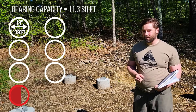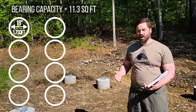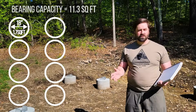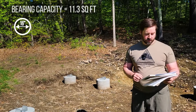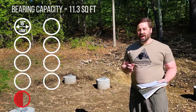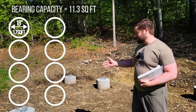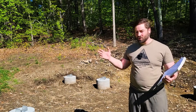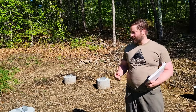So we take the 11.3 square feet that we need and divide it by 1.7 square feet per footer, and that means I need 6.6 footers. You can't have a fraction of a footer, so we could round up to seven, but then we'd have three on one side and four on the other and that wouldn't be even. So I brought it up to eight footers - now we have a nice margin of error, four on one beam and four on the other. As a side note, if I had chosen to use 16-inch diameter sonotubes, each one would have had about 1.3 square feet of bearing surface and I would have needed to round up to 10 footers total. You need to know the bearing capacity of the soil, the total weight of the structure, and divide that out by the area of each footer - that's how you get how many footers you need.